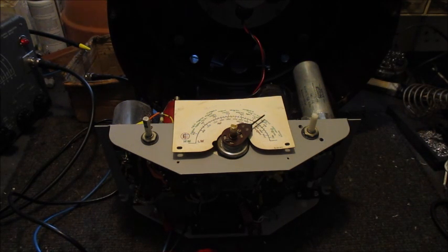I'll not consult the circuit diagram since IF alignment is straightforward enough. You start the furthest away from the frequency changer or front end, then progress back towards the front end or frequency changer. The intermediate frequency for this particular model of radio is 480 kHz.